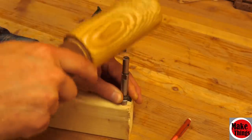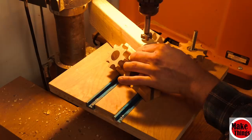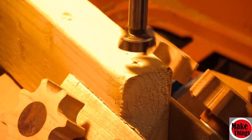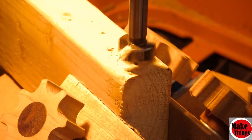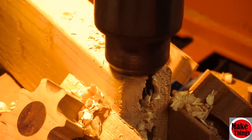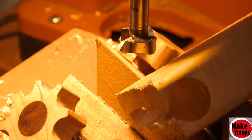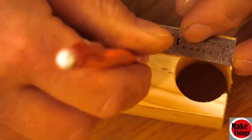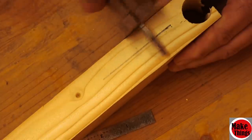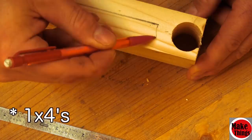Here I'm using an ordinary 2x4 and drilling a 1-inch hole. If you don't have a vertical clamp, I've made one you can take a look at — I'll have that link in the description. I'm not normally one that uses 2x4s in my jigs, but I needed a little more thickness for the inch I drilled out. The rest of the 2x4 I trimmed down to be the size of a 1x4. If you don't have a 2x4, you could always stack a few together to do the same thing.